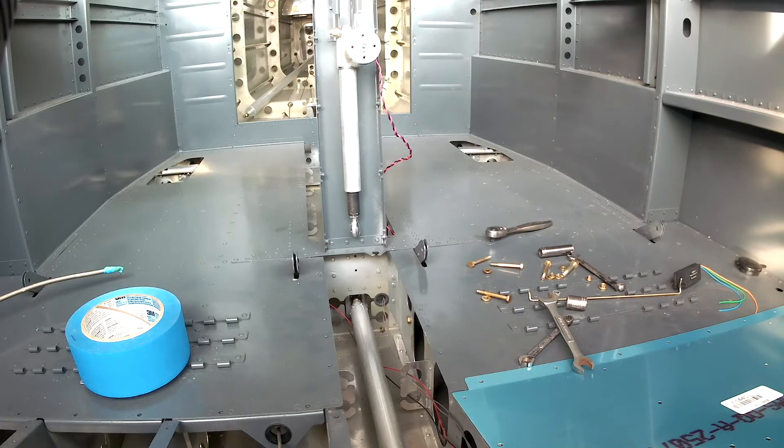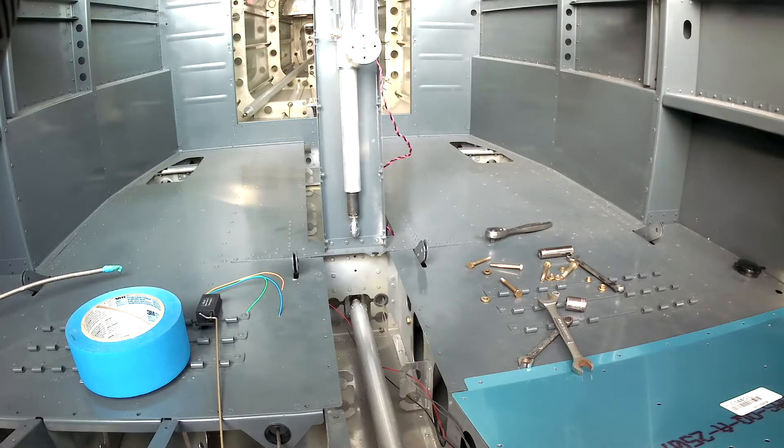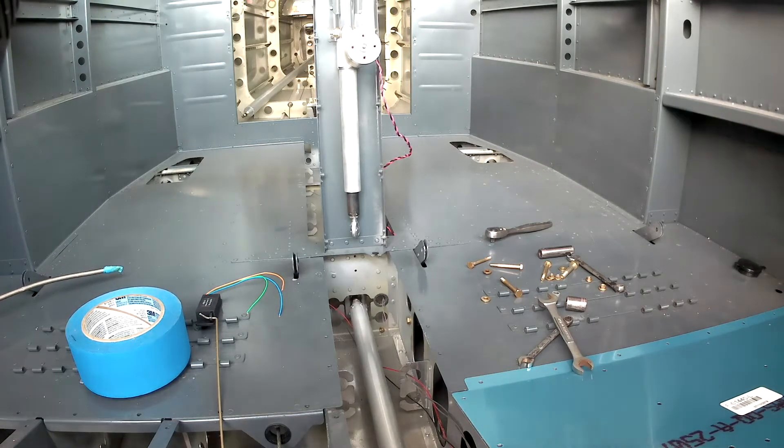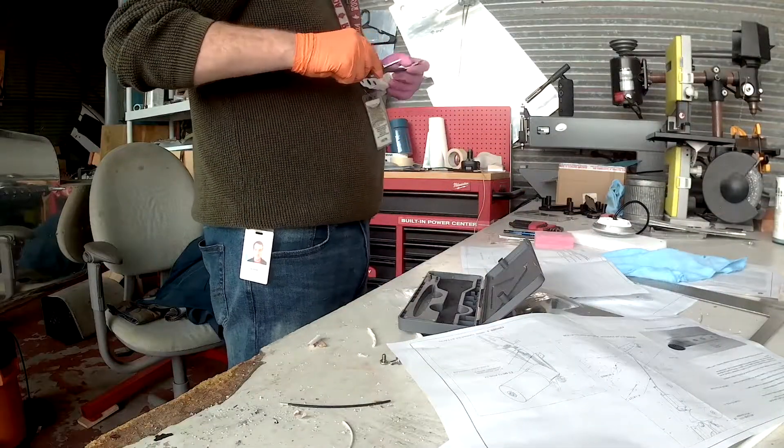The position sensor stays in place, and as the arm rotates it pulls the position arm in and out. All it is is a rheostat or potentiometer — it's made to vary resistance based on where the arm is. In layman's terms, it uses resistance to measure where the stick is sticking out of the box. It just comes back as a number, and it's a 5k potentiometer.